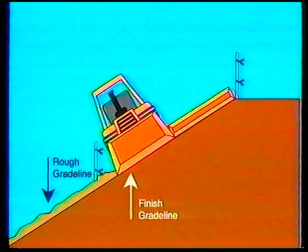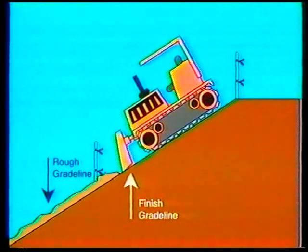Grade can still be maintained by setting the high side of the dozer on the existing grade established on the previous pass and matching the reference mark on the low side of the dozer to the corresponding hike-ups on the next stake row down the hill. Begin cutting along the slope stakes using the hike-ups and reference marks on the back of the dozer to help achieve the grade. Keep the machine at a slow pace and be sure not to undercut the slope.